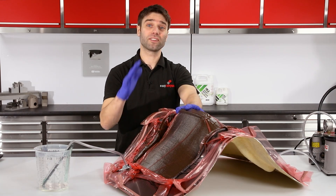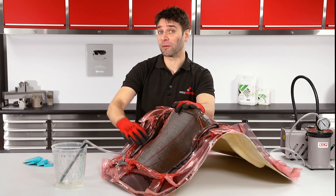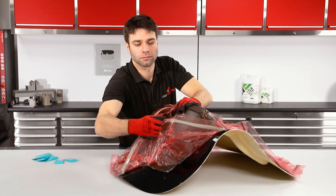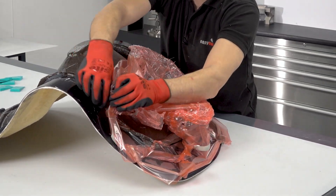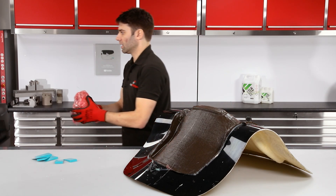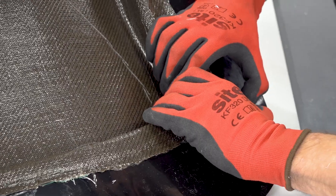Now that we're clamped off this can be left to cure — about 24 hours at room temperature. This is now fully cured so we can tear it down and pop it from the mould. The resin cleanly cracking when flexed is a good indicator that it's cured sufficiently for demoulding. The bag can then be removed — I'm considering this vacuum bag a consumable and will be disposing of it, though with very careful removal it is possible to reuse it. The actual amount of waste plastic produced is less than you'd find in a drinks bottle, but if you're trying to reduce waste as much as possible it's certainly worth trying.